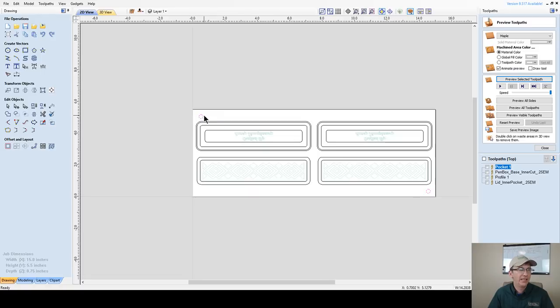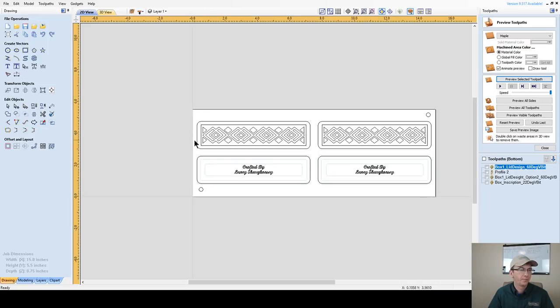All right, on this, I need to copy to the other side. Now I can go back over. All right, let's go ahead. This is my bottom, which is technically the top of my box, but the bottom of my board. Let's go ahead and create the toolpath. Now, these two alignment holes are going to get cut in the waste board. In the preview here, you see it getting cut on the bottom of the board. No, it's going to get cut in the waste board. I'm going to explain that in just a second, but let's create the toolpath.